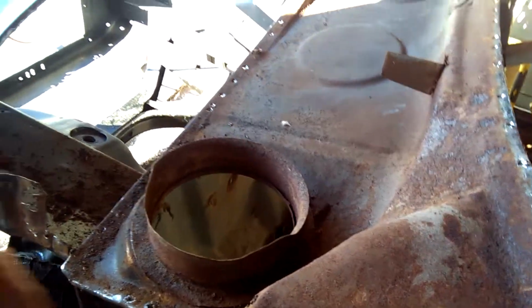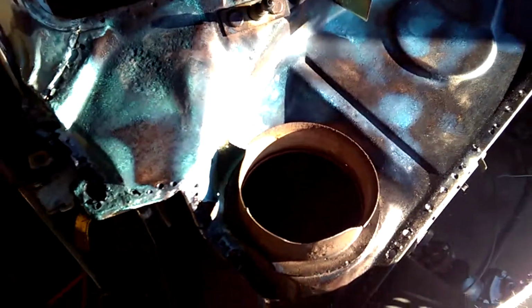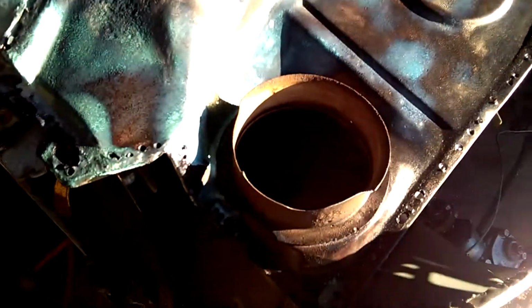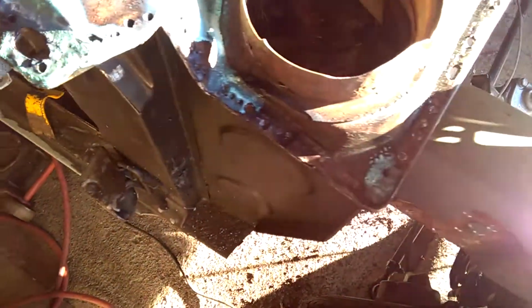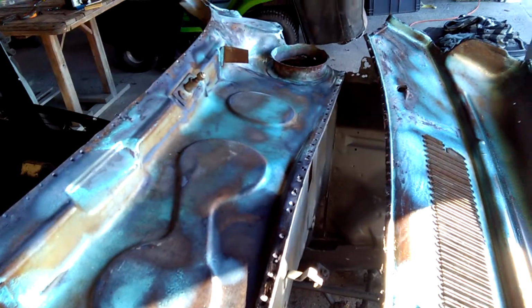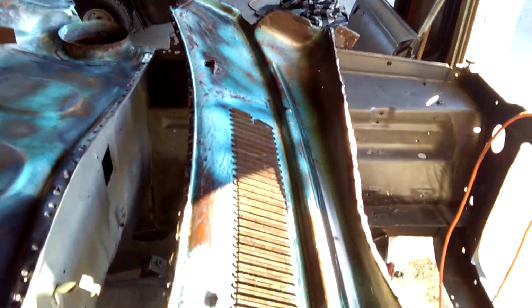Alrighty. There you go guys, back again, after a bit of a reveal before pulling this off. So I got in there quickly with the old rotary wire brush and the grinder and one of my die grinders so I can get in these tighter spots. Gone around, given it a pretty good clean up. I've given it a good coat of rust kill in the meantime, so that's had a good dose underneath there.